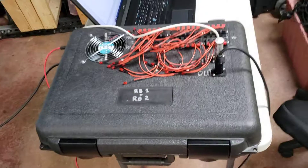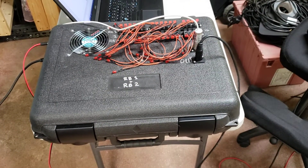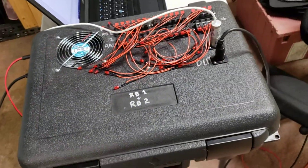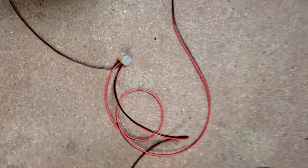This first box, you'll see, is much larger than the others. This contains a 12-volt DC 50-amp power supply. It's placed right here underneath this fan for cooling it. Coming out from there is this 12-volt power cord, which goes along about every 20 feet. It has a junction where another cord comes off and plugs into the next box, and then it goes again and has another junction where another cord plugs into the third box and so on.